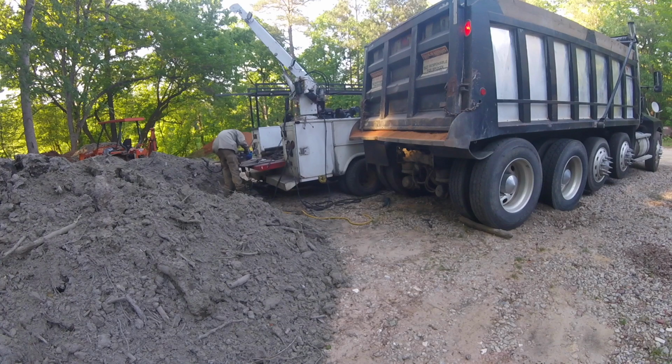Guys, now I got the compressor fired up. Now I'm actually gonna get started with the AR, just because it seemed to be a lot more effective than trying to do anything else to get all this out. There's a lot of old weld that was cracked that I had to gouge out. Like I said, there's just a lot of prep involved in this job, and that's the one thing I tell y'all about. Whenever you go to repair stuff, most of your time is going to be prep. It's not going to be actual working. But that's about what we're doing here. We're going to gouge them out and get them welded back up.